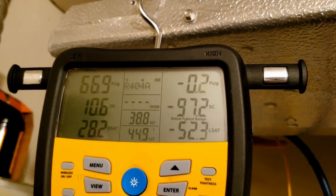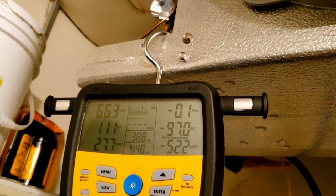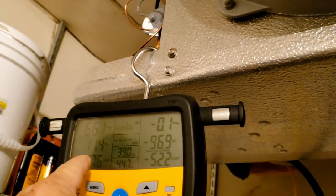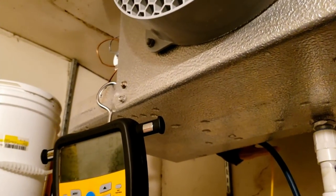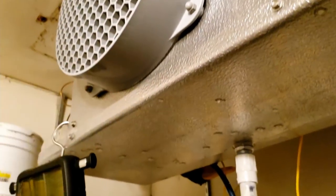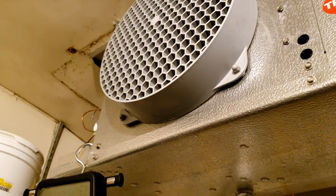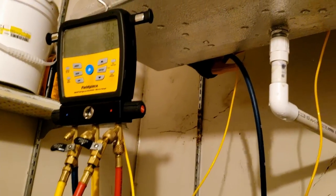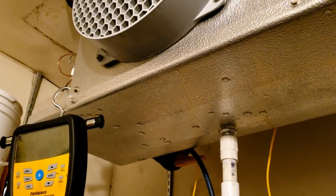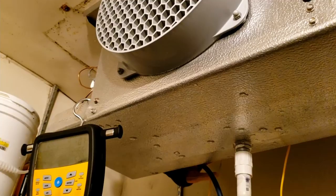We've got about a 10-degree TD. TD is temperature difference — the difference between your suction saturation and the box design temperature you're shooting for. So if you want a 38-degree box and you're running about 27-degree saturation, that's about 11 TD. That's different from delta T, which is input versus output. On a cooler the TD isn't very high — maybe 8 or less — not what you're used to with a home air conditioner, which is somewhere between 13 and 25-28 degrees depending on the system and ductwork.